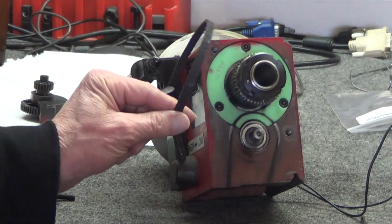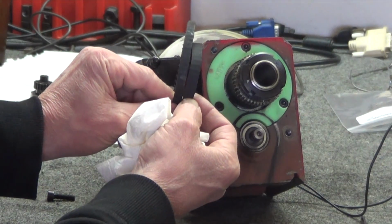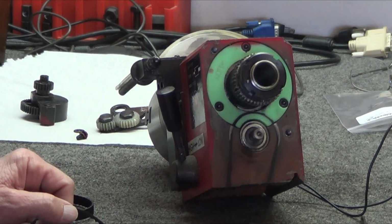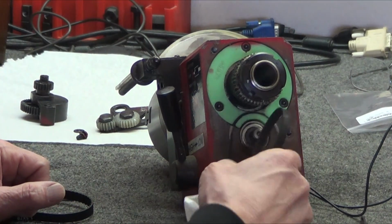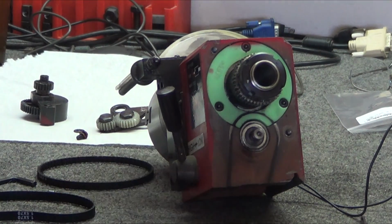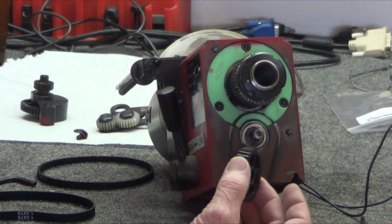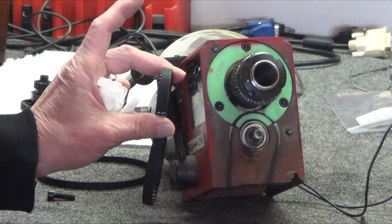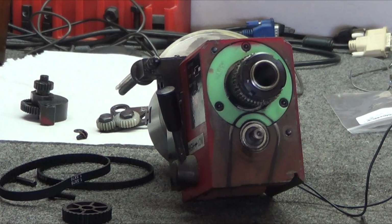Also the belt, this is the original belt, and you can see the new belt. It's a lot wider, and I think this was originally that wide, but you can see the shiny spots here. I think the motor was crooked, and it was running the belt into this and just slowly wearing it down over time, because there was a lot of belt fuzz in the housing here, down by the motor. So you need to check. Pull the cap off and see if you're wearing your belt out, and adjust the motor so that when it's running it stays on this gear, because the new belt is just as wide as this gear, right? Yeah, it's a little bit skinnier, but so now I got to figure out how to make a keyway.